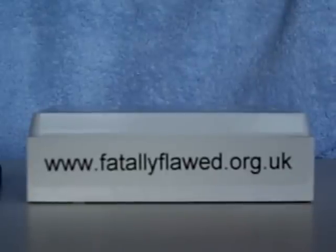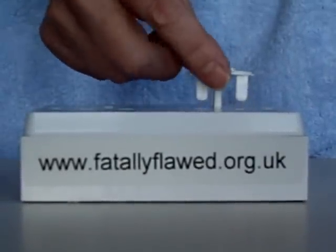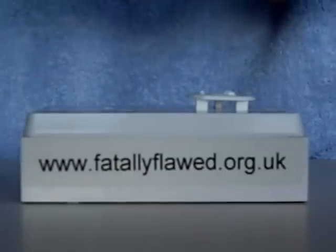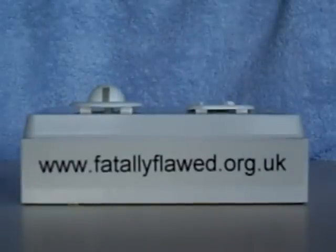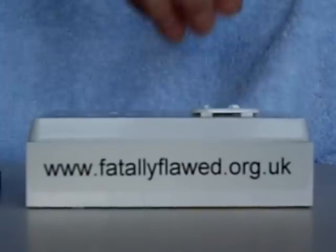I've now got a different view of the socket, looking at it from what would normally be the underside. I'm going to insert an IKEA or Mothercare type cover, and also a John Lewis type, also sold under the ClipperSafe brand and also by Boots. I want you to watch what happens when I take my fingers off — as you can see, they both pop up. The reason for this is that the pins are actually rather short. Almost all, if not all, safety socket covers are manufactured with short pins, meaning the pins do not properly engage with the contacts. If the shaped part comes into contact only with the shaped part of the receptacle, it just pushes it out. The result is that they're very, very easy to remove.